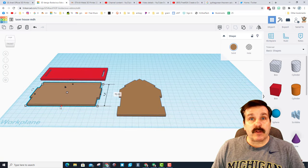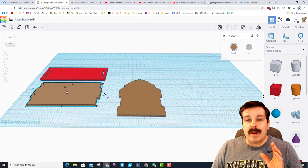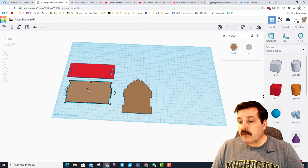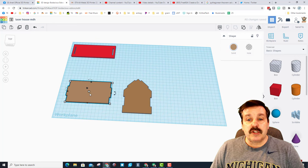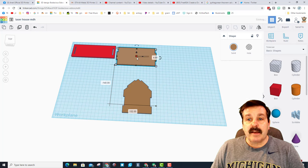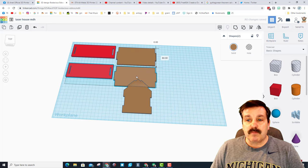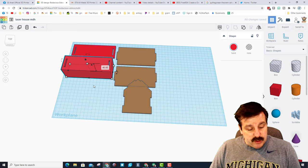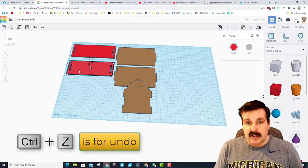Just like that you have built the parts for a laser-cut house - you don't have windows yet, you don't have a door yet, but let me show you how this gets arranged and I'll let you make those cool things on your own. First let's make sure our grid is back on - I'm going to set it to five. I'm going to bring this up to the upper left edge, bring this up beside it, and I need a pair of those so I'm going to select them both, do Duplicate, and bring them down. Always arrange everything so it's used most effectively.